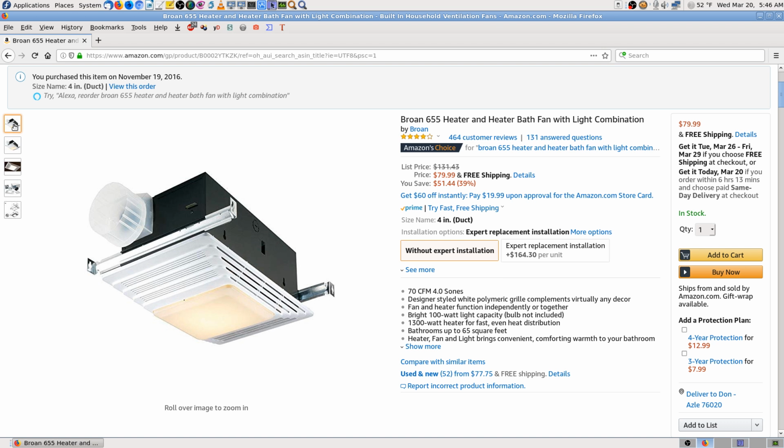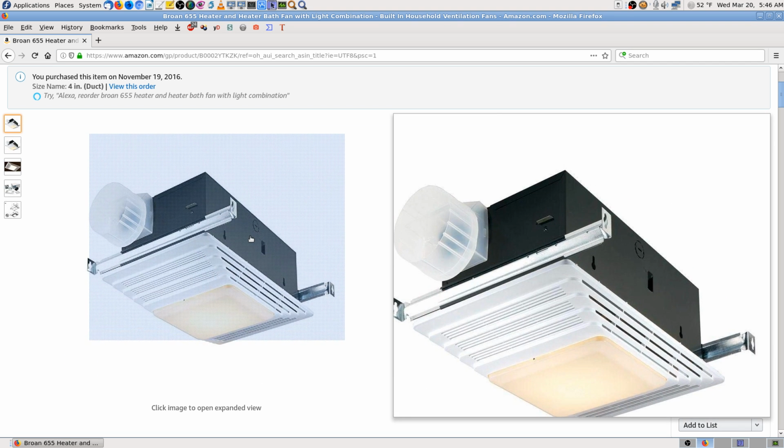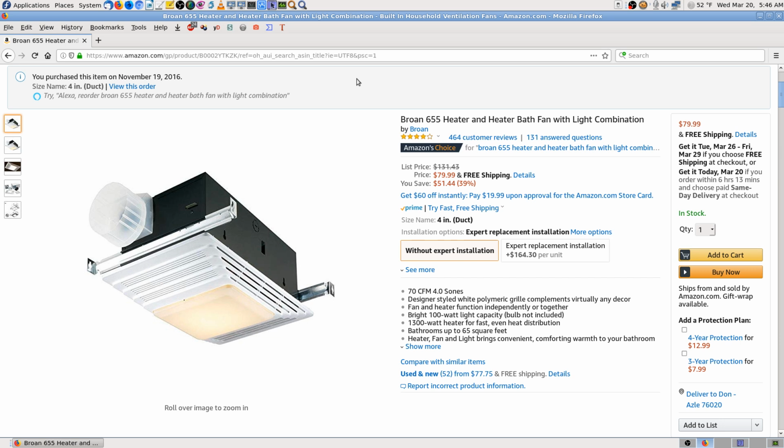Measure out, and then you'll know, if you put that in the center of where you want it, you're not going to be more than 2 to 4 inches out from where you figured it was going to be. You can't put it exactly where you want it, because you have to have those mounting brackets line up. But ours looked great. However I did it, I figured it out. Anyway, then you do the rest from up in the attic. You center your box over that, your nail or your tool. Make sure it's going to hit the rafters, the mounting brackets, and then draw around it with a pencil or something, and then drill some holes, or just use your sheetrock saw.